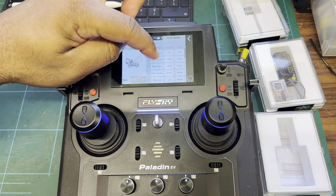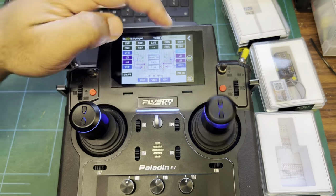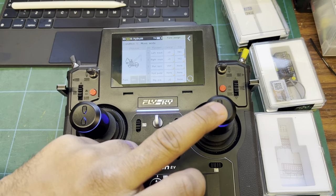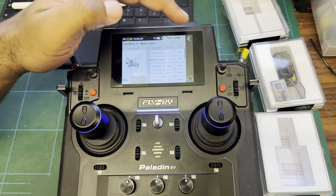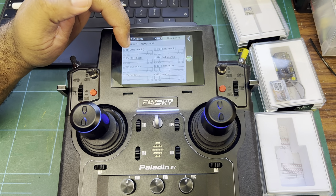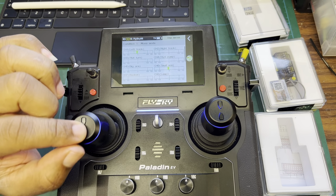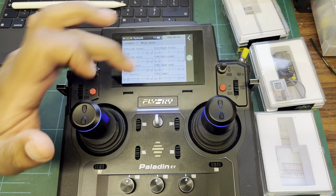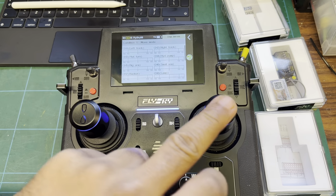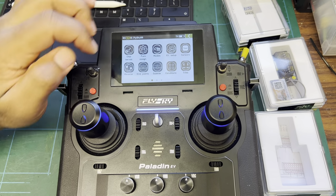If I want to use the right track to control this lever, then I would use jumper 2, and as you can see, jumper 2 now controls right track. To get further proof of this, you go servo, display servos, and then you can see your left track. Don't worry about the small arm, your left track is not controlled by that, and your right track is not controlled by that. And that brings us to display servos.